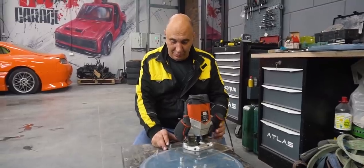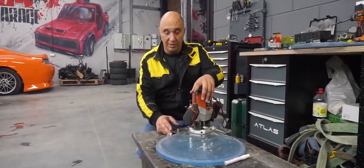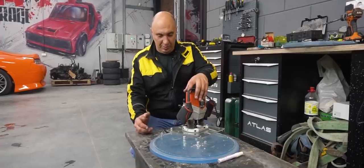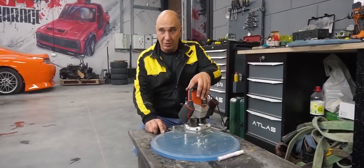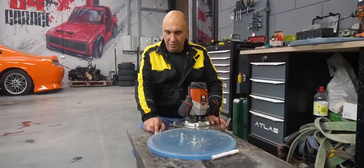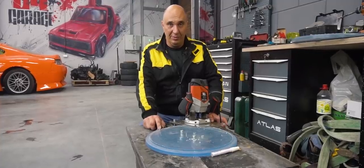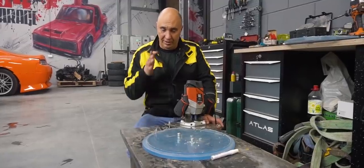So I'm currently adjusting the base to get 2 stop points going. After that, we adjust the recess depth. We literally need to remove about 1 mil across the board. But that's not the only problem we're facing. The 5 millimeter groove depth that we specified in the diagram... Okay, so I don't know what sort of precision CNC machine they were using, but we're looking at a depth fluctuating between 6.5 and 7.5 mil. And a 1 mil discrepancy is quite a lot, especially when we mount this to the rim.